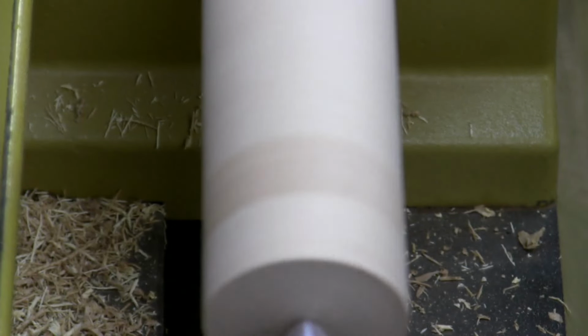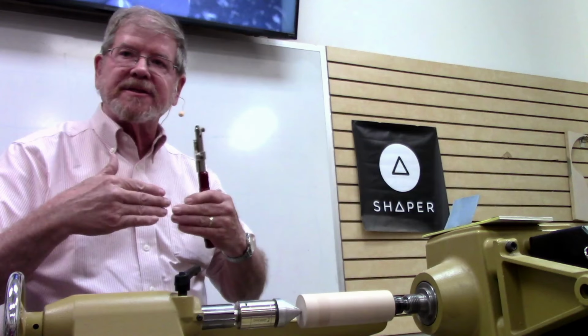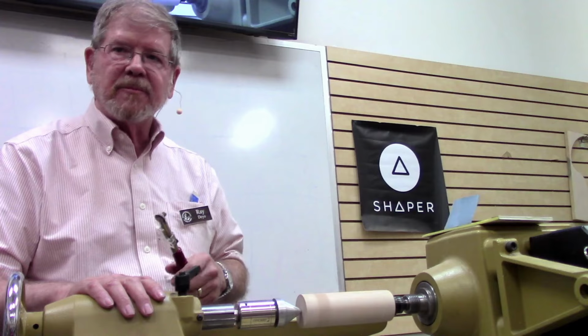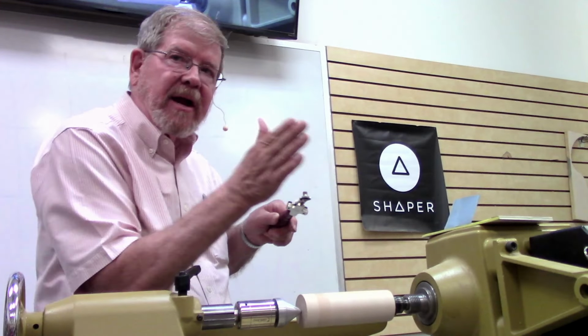I think the question is, after you've done the first cut, when you go in the second time, is it the fact that you're going in slowly, it kind of refines, it self-registers? It self-registers, yes. So it's just reminding itself of what's already there. Right, got it. And because it's cutting on the tip only, it's cutting each spiral a little bit deeper.